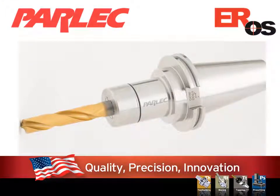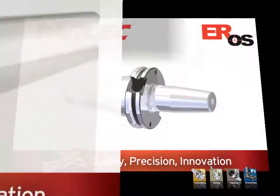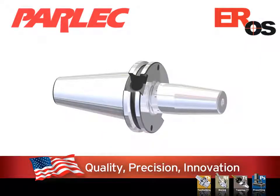If you still have reservations about the value of ERos, let's compare it to other high-velocity, high-precision holding systems. Let's start again by taking a closer look at how it compares to heat shrink. The shrink philosophy is quite simple, but the practice isn't always. Heat up the tool and the thermal expansion of the bore creates clearance to install a tool. As it cools, it grips the tool. Not a lot of time available to set cutter lengths or make other adjustments. Make sure you wear your gloves.